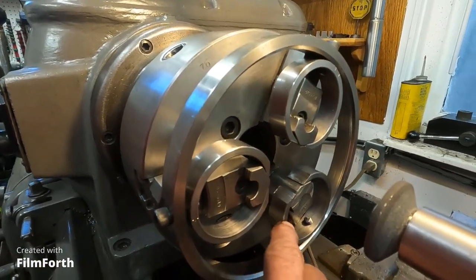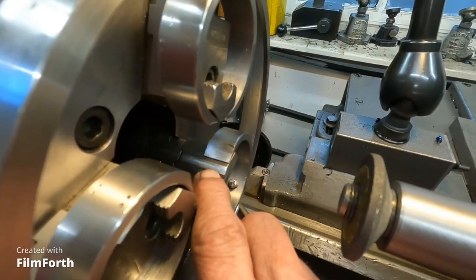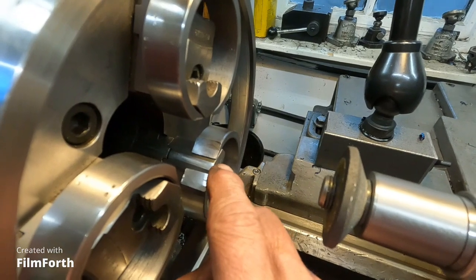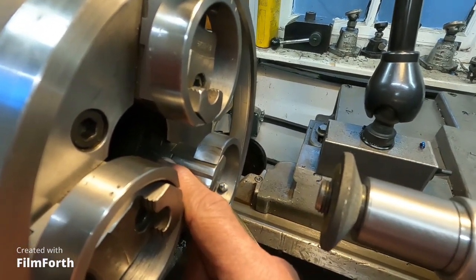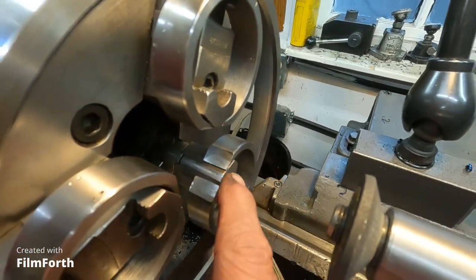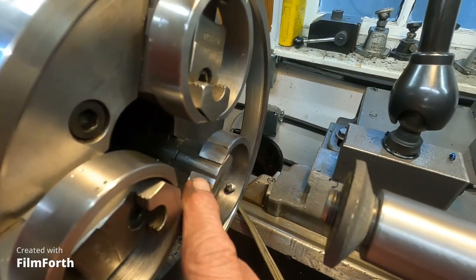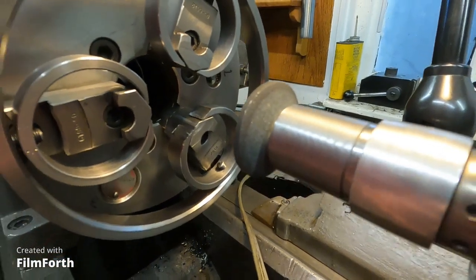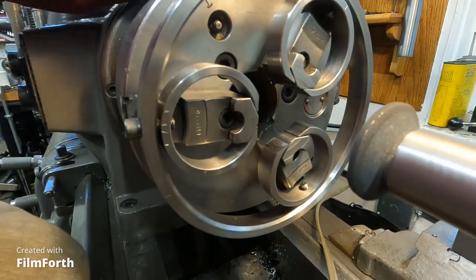and have more of that condition. I can see, I don't know if you can, that the wear has made it a little wider here on the jaw face, then a little bit in towards the master jaw. I don't know if you can see that or not. But I'm going to put ink on these, and then I'm going to get this set up and grind it, okay? And I want you to see how that holds.